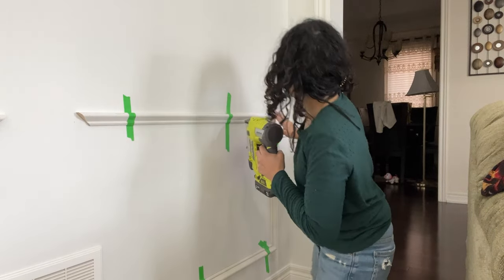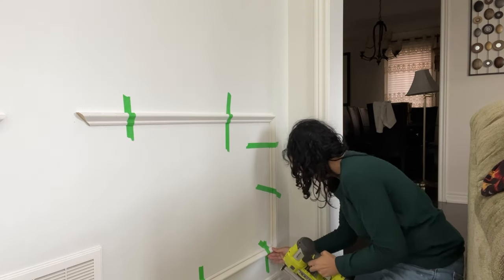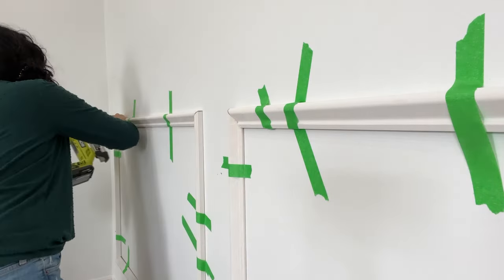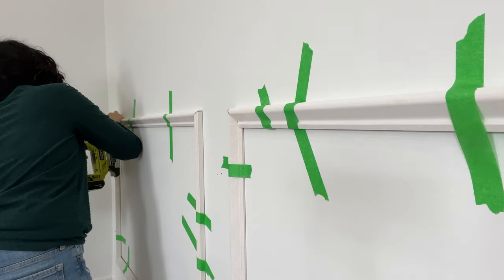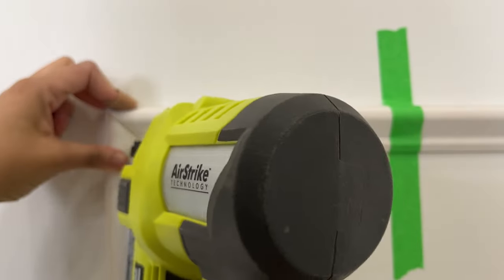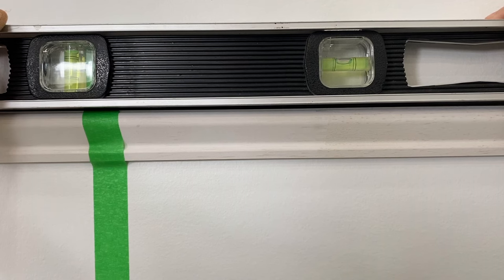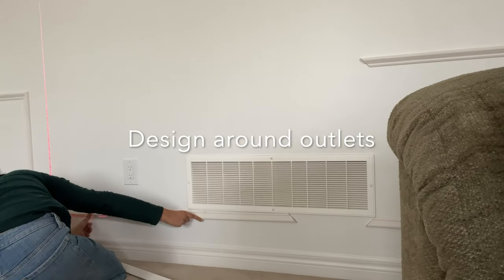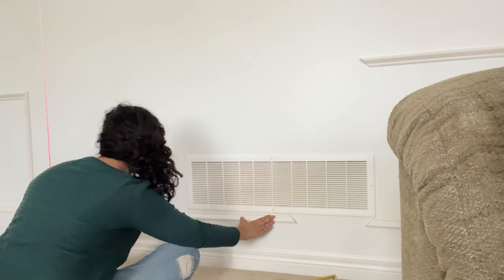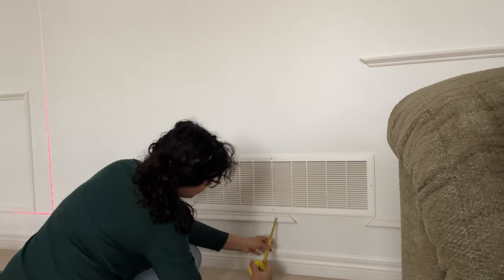To attach your trim to the wall, use a pin nailer — it's the best tool for this type of trim. Do not use a brad nailer; the nails are way too thick and they will often split the wood. I have a full tutorial on the difference between a pin nailer and a brad nailer and I highly recommend you watch that if you're not convinced. When nailing the corners, make sure to squeeze them together so you get a really tight fit, and it's always a good idea to double check your pieces are level before you nail them in. Before I started this wall I took into account the vent and decided to design around it — I think it looks better if the trim is below it versus cutting through it. These are the kinds of things you should plan out before you cut your wood.